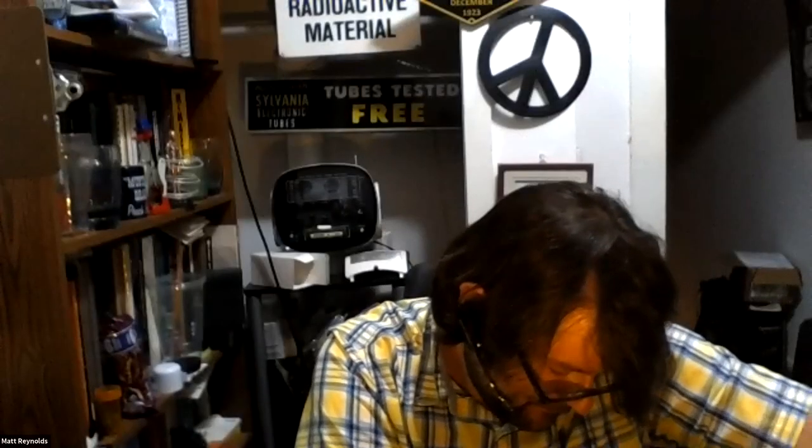Are they pretty directional? Like you have to turn it a certain way? With the long wire. No, it's got a wire. Okay. And one bit of trivia on the 100 milliamp tubes: if you swap them out as a complete set for the equivalents with the 150 milliamp tubes, they'll work just fine in any AA5 radio.